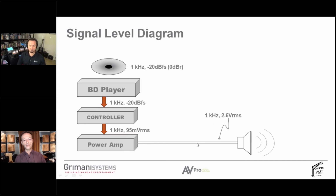Let's talk about this. If there's a drywall screw right here that went into the insulator and it's not shorting out the wire, you have signal. At 100 millivolts, it'll pass. As you go up in voltage, there's a point at which the signal may short out. It's going to ionize, do what's called a Schottky diode effect. And at some point, you're going to see that one channel, instead of putting out, actually Schottky diode starts a little bit higher in voltage. It's really at 3 or 4 volts, but you'll see that speaker, for one, sounds weird.